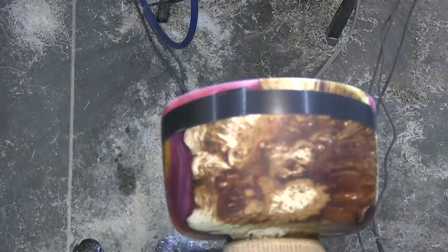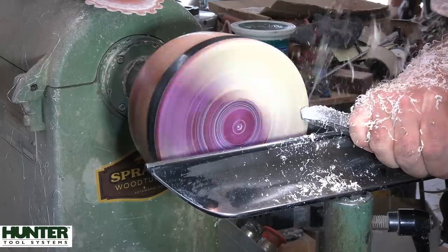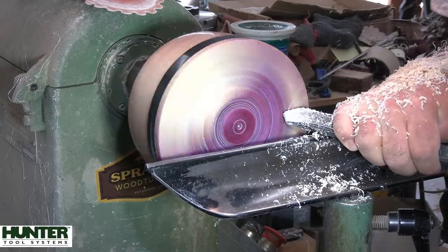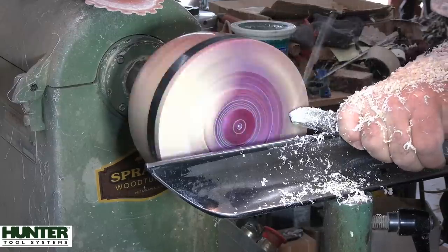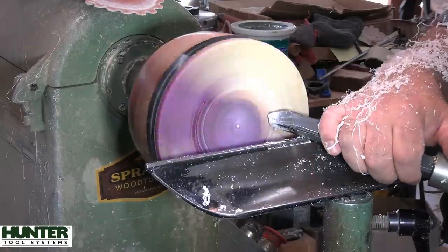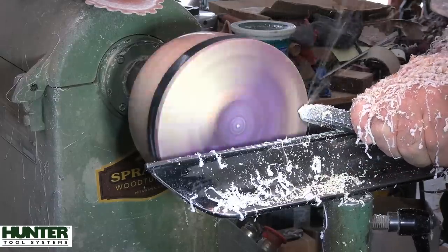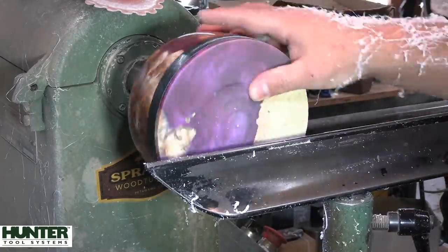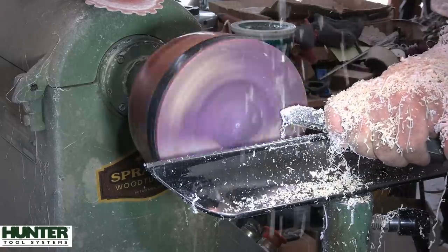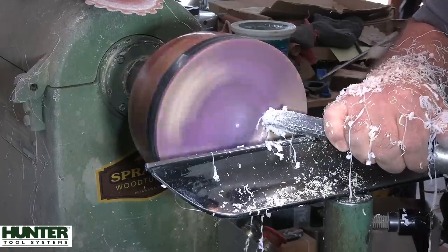Electrical tape is your friend here. Now, if you go back to where I was cutting the lid, I never go from the base out to the top. It's generally from the very top of the lid in towards the body — so you're essentially pushing that lid onto the body. If you try and go in the other direction and get a catch, it could definitely be a devastating one. So as long as you always go from the top down the body of the piece you're working on, you shouldn't have any issues.